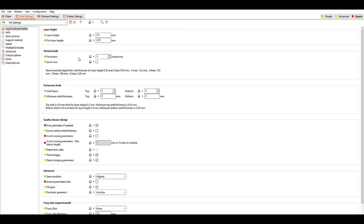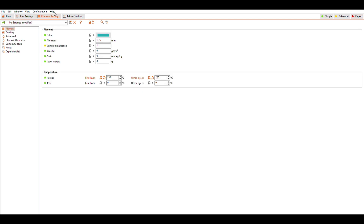These layer heights don't seem quite right, and it's also saying my settings were modified, which I hadn't changed anything. I had emailed this 3MF file between two different computers that use two different slicers, and possibly between opening it in a different version maybe I changed something and didn't realize it. I jump over to filament settings — I use 230 and 220 for my filament temperatures and I'd been fine-tuning that, but I didn't realize the bed temperature is set to zero. Obviously that's not going to work.